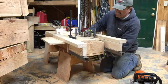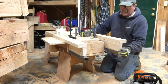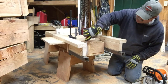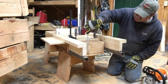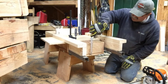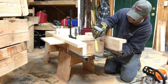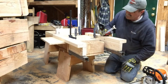Now we're going to cut the horizontal cuts in the tenon. We cut the two shoulder cuts — one from the top and one from the bottom. I have a fixture to hold the saw horizontally. Because I use this fixture for a couple of different jobs, I took a test cut and measured down — I have it set up for 5 inches. On this particular piece we're only 6 inches, so the top of my cut has to be at 4 inches. We're going to raise the whole fixture up an inch, then another 2 and 3/8 inches to come to the top of the tenon. The tenon is 2 inches, and the cut is about 3/8 of an inch, so from the bottom we move up 3/8 and then 2 more inches to cut the top — giving us a nice 2-inch tenon in the middle of the timber.